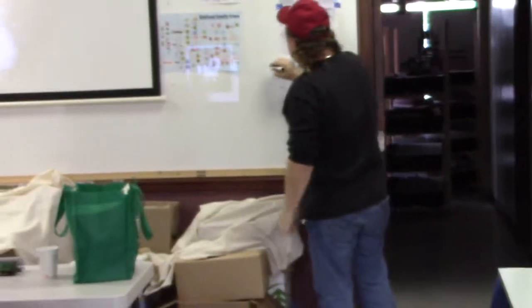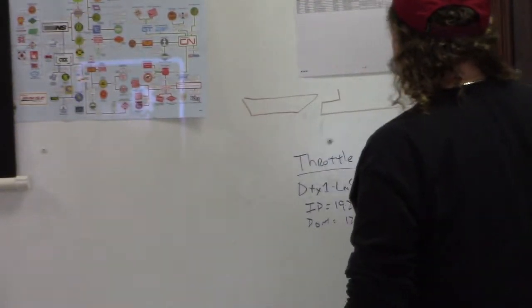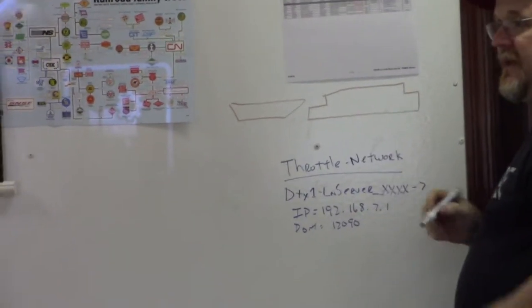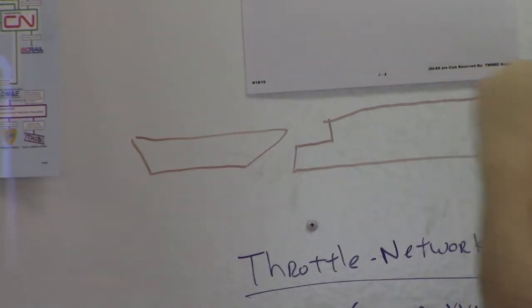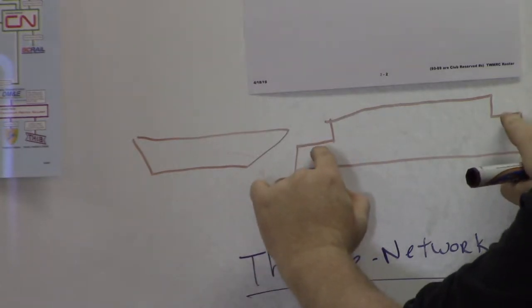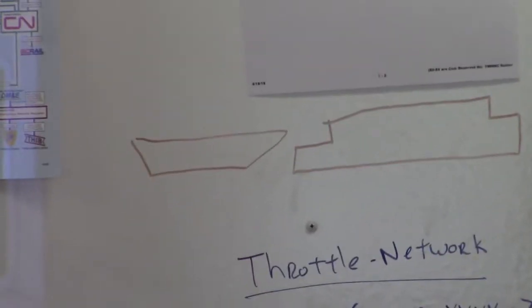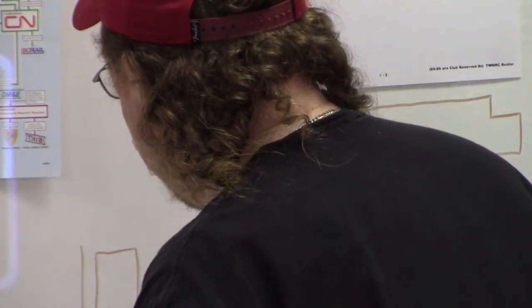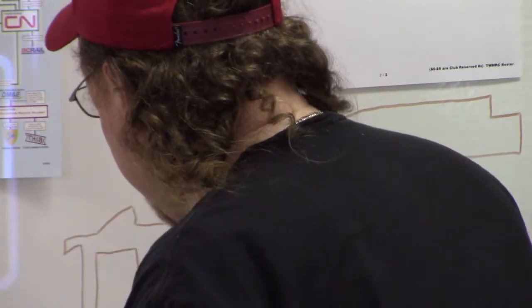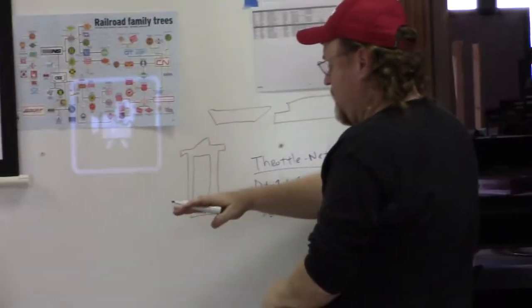All right, so what you have underneath the window, there's a piece that looks like this. Then there's another piece in there that looks like that. That's your windowsill. So if this is your window, this gets mounted in this way, and this little bump out right here goes inside the window opening, so that this piece is sticking out and is actually glued to the outer wall trim of the window. So what about the piece on the left? That gets glued underneath the windowsill, below the sill, and then this goes in this way, right here along that line.